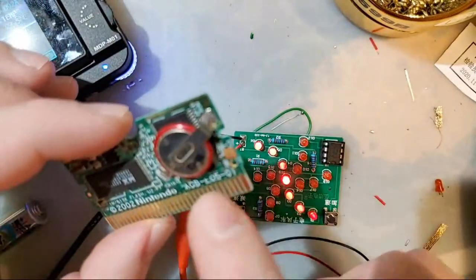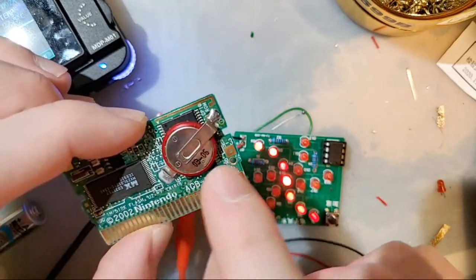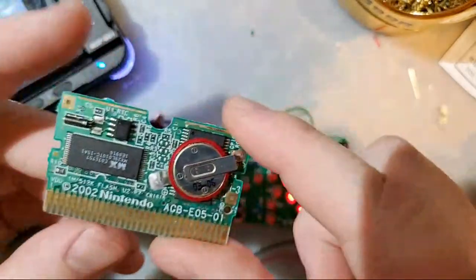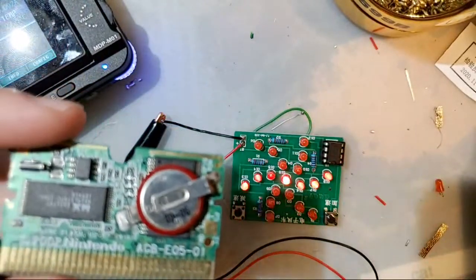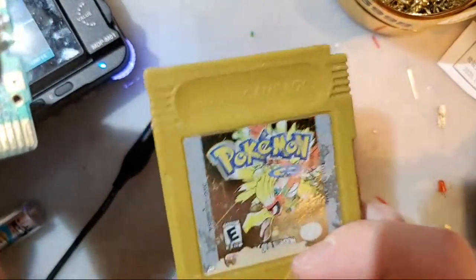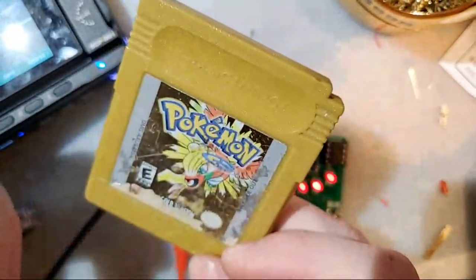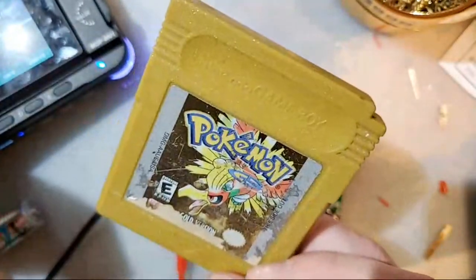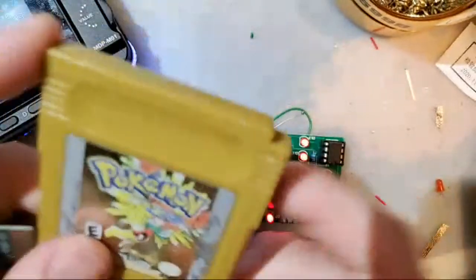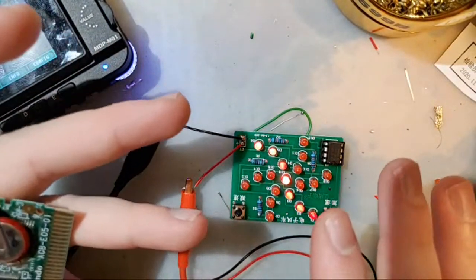If you're prying the tabs off, you are risking permanent damage to the PCB itself. Chances are pretty good you're doing it on a Game Boy Color game, not a Game Boy Advance game. You know, little indie series called Pokemon. If you're prying the tabs off of one of these bad boys and shoving a battery in that way, it's not going to make good contact, and your save is on borrowed time. You could lose your save literally at any time if you accidentally bump the cartridge wrong, and it's just not worth it. Buy the tabbed batteries, please.